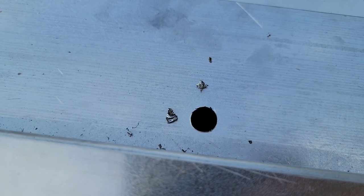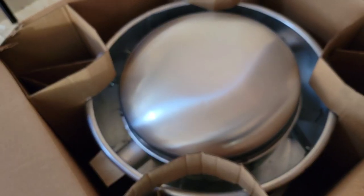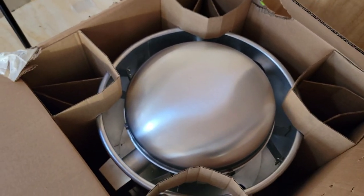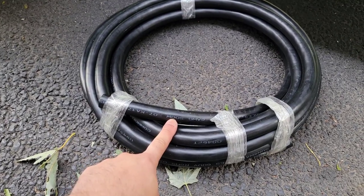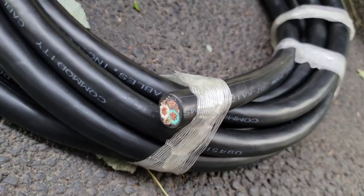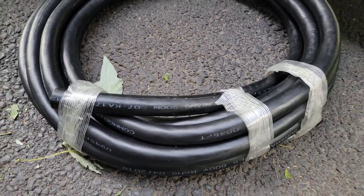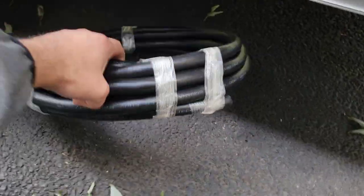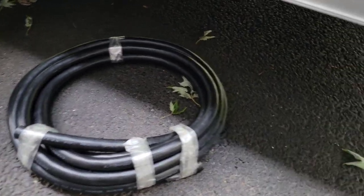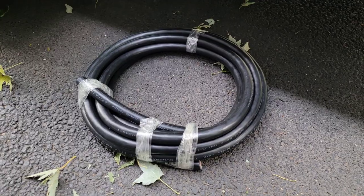Here's the new exhaust fan — they do a great job packaging it, and it arrived in good condition, shipped from Ohio. I have six-gauge three-conductor cable — SOOW cable — for 120-volt power: the power wire, the neutral, and the ground. I ordered a 25-foot roll on Amazon, which was actually cheaper than my local electrical supply house — about $90 for 25 feet of six-three gauge wire.